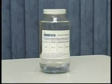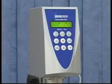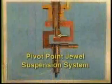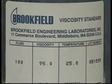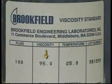However, many customers choose to do so as a simple verification check. The calibration routine checks the linearity of the spring on the instrument by using one fluid at three separate speeds to achieve low, medium, and high torque ranges. This checks the linearity of the spring and the sensing mechanism of the instrument. A 100 or 500 centipoise silicone fluid can be used, as these lower viscosity fluids are easier to work with and to clean. Use the actual value of the fluid, not the stated value, for the calibration check.